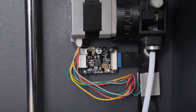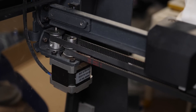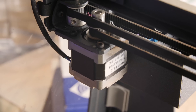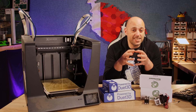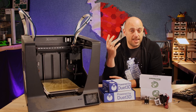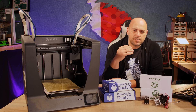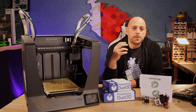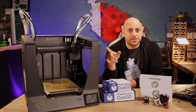So I had that replaced and it started working again for a few weeks, then I had one of my motors seize — the X-axis motor. For some reason they tend to seize. So I ended up replacing the stepper motor and the driver for that stepper motor as well. Then eventually there was the Sigma R19 upgrade, which I also got and upgraded. And for some reason it started under-extruding again — turned out I had another stepper driver die.